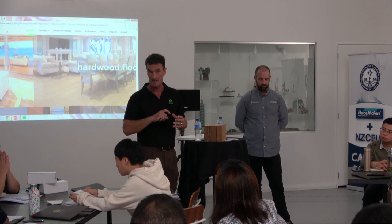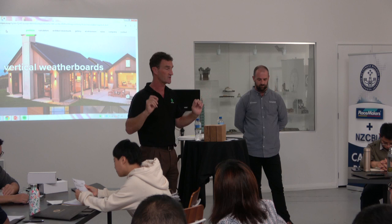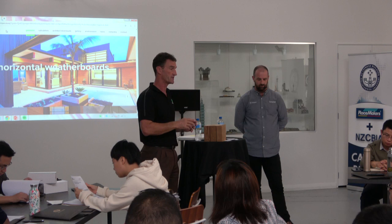You can actually use the batten as a cavity closer around the base of walls where it's not going to be seen. Where it's going to be seen, like above on a soffit line or above doorways or garage doors, you would perhaps use the aluminium cavity closer. It looks a lot sharper. But where it's not going to be seen, it's another option. So there's options on options. Make sure you specify the batten that you're after, which is the V1 Verti Bat, because there are a lot of battens in the market.